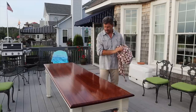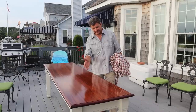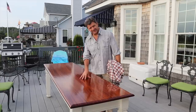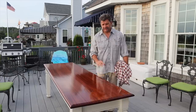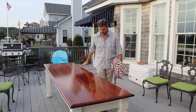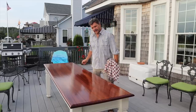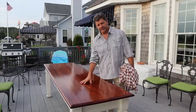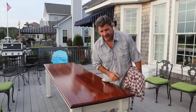It's been about a week since I put the new tabletop on and it's doing pretty good. Of course it's been covered with a tablecloth. Right now this has six coats of a gloss finish. Ultimately I want a satin finish, but even if you want a satin finish you need to start off with the gloss — that's going to give you your most protection. So now I'll go ahead, sand this again with 320 sandpaper and apply another coat, this time using the satin finish. I'll let that dry overnight, sand it again tomorrow, and apply one more final coat of the satin finish.